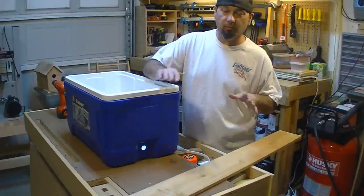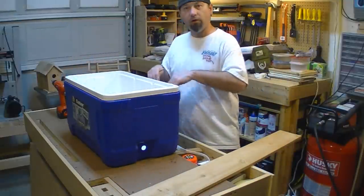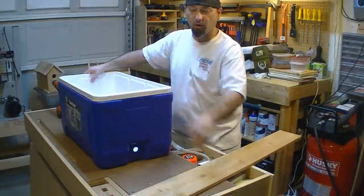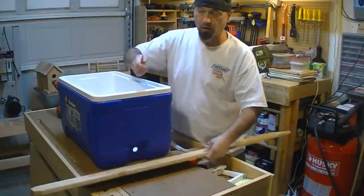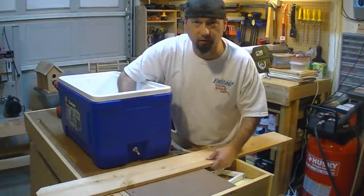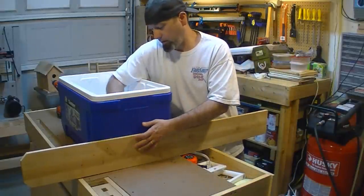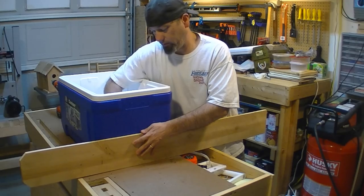Let's imagine that the carcass of the cooler box has already been built — we're at the point where there's a square box all the way around. I set this inside the box; this represents the bottom half of the box. What I'm going to do is get this pencil and poke it through this hole from the other side. Here's the wall of the existing box — I get this pencil, put it straight through, and make a circle.